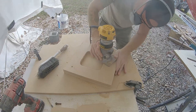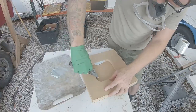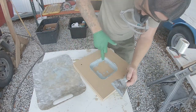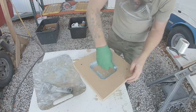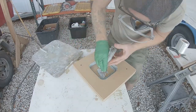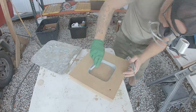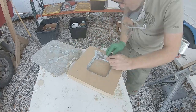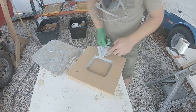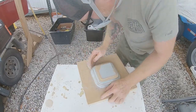I like to round off the top of my molds a little bit so that the glass tends to fold outward when I lay the glass — if it had a 90-degree angle there, the glass would want to flip back inwards and cause air pockets. So here again I'm filling the crease with some Bondo, spreading it in with my fingers, then using that same piece of hot glue with the radius on it — you can use a popsicle stick or whatever has a nice radius — and cleaning it up with the spatula so I have less sanding to do.